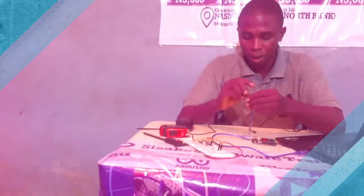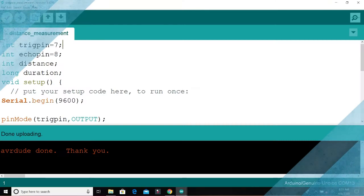So I want to do the connections now. You have the VCC, the trigger, the echo, and the ground. Green is the VCC, so we take the green to the 5 volts. From our program, the trigger pin, which is the next one, blue, is going to pin 7, and the echo pin is going to pin 8. This is pin 8 on the Arduino board, this is pin 7, then the ground goes to ground. So what we'll be doing now is to open our serial monitor on our laptop.